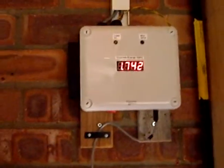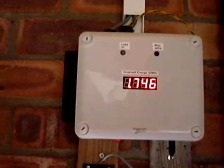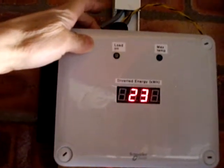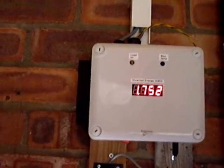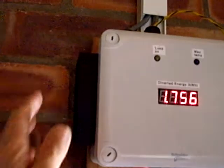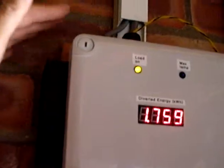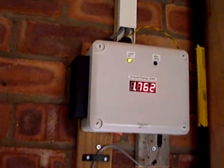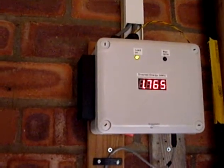One thing that might be interesting in this particular box: I have a temperature sensor in here based on the latest data log sketch. If I operate the little button up at the top, we can see the temperature in the box. The temperature is 23 degrees, which is no doubt warmer than the ambient temperature in the garage, but it shows that the inside of the box is not overheating. We've got something like 50% load, the heat sink is warm to the touch, and I can feel a little bit of warm air going over the top. But you need a reasonable heat sink with decent cooling just to keep the electronics cool, and clearly the inside of the box is plenty cool enough at the moment.